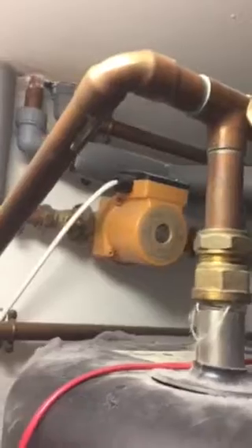Up there is the domestic hot water circulation pump which is connected to a timer — it's very high tech, though I'm not sure why it's not more sophisticated. As you can see from the notes there: towel rail and hot water pump. It pumps hot water around the system including the towel heaters in the bathrooms, which we don't put on very often. Then we have a timer that's no longer in use, and then an immersion heater timer controller. That wire goes down and connects the immersion heater at the bottom of the tank.